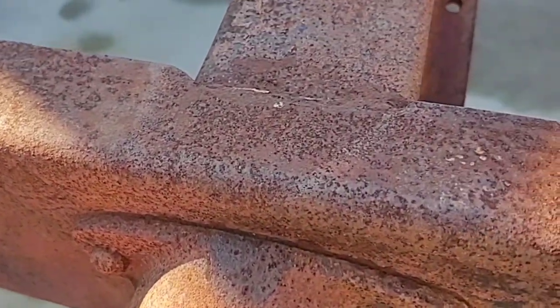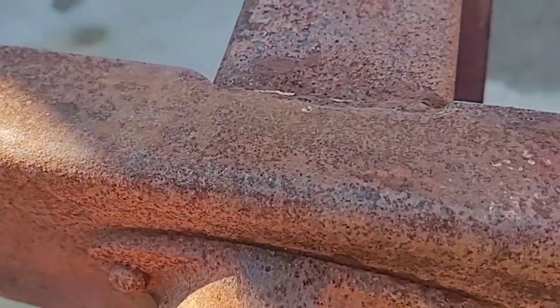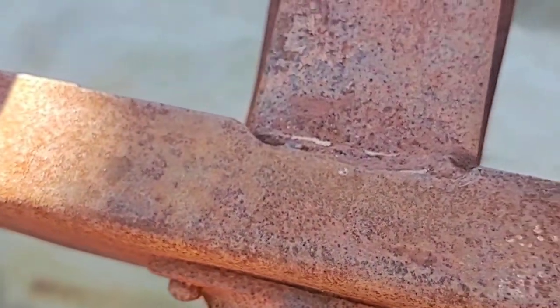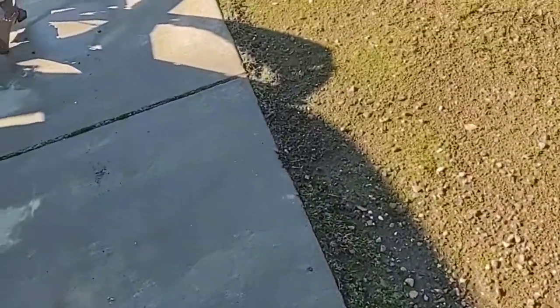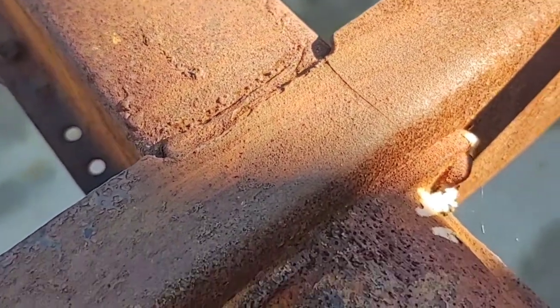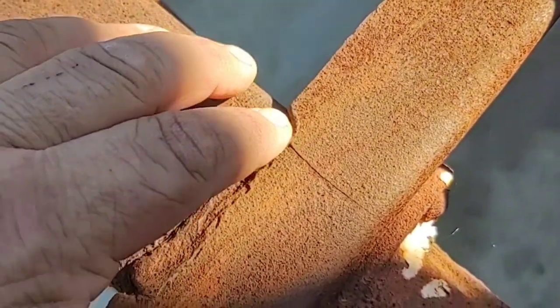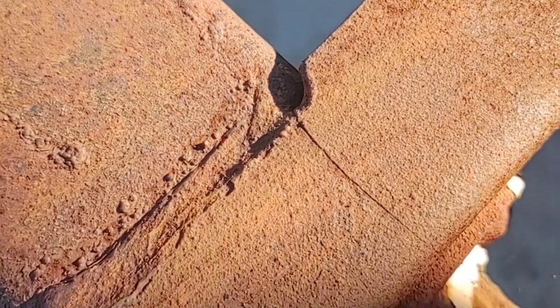Let me dust it up so you can see my finger tracks — that's where you look for cracks. I don't have my glasses on, so if you guys spot one, tell me in the comments. But here's one I know exists — that's what they look like. When they welded this one, they really dug it out but left it kind of bare through here — they didn't do an amazing job of welding right there.